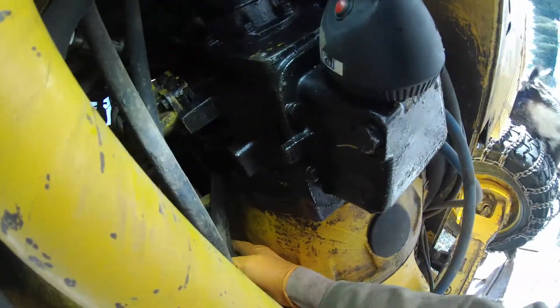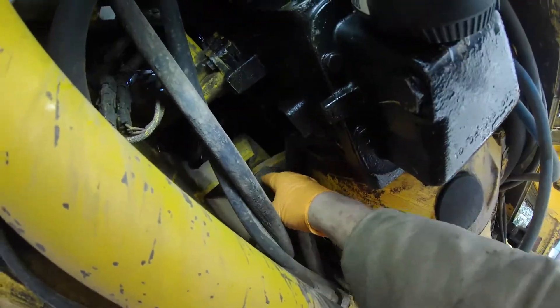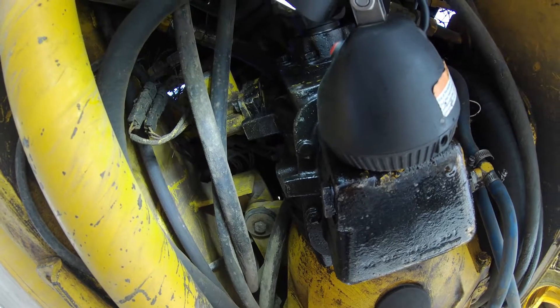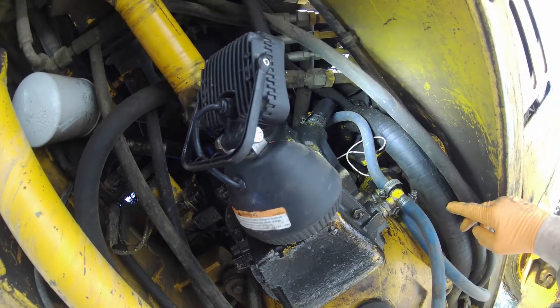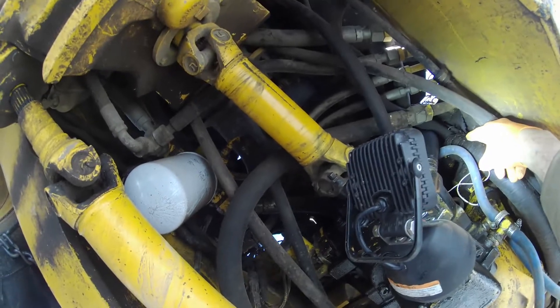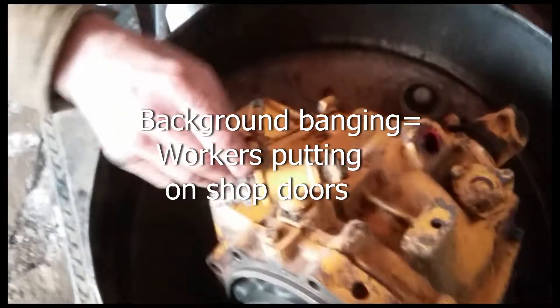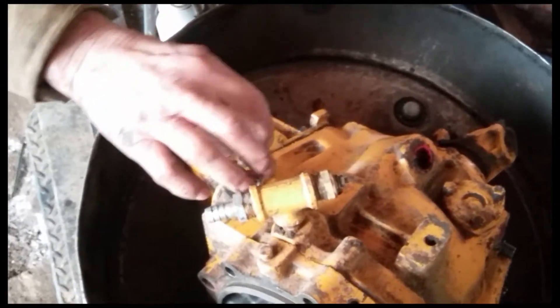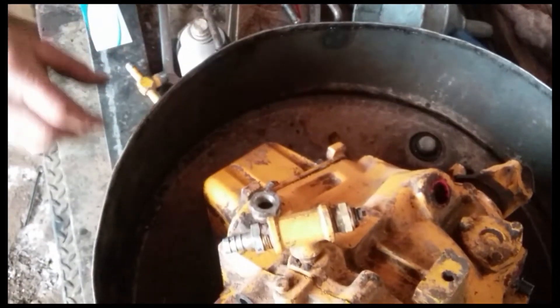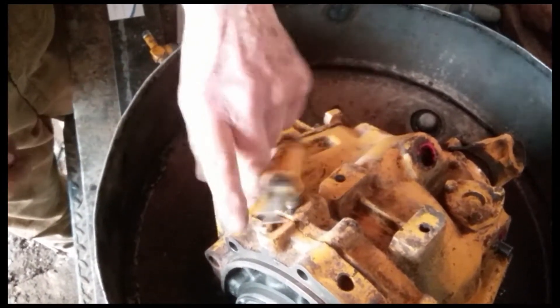This hose here also had to come off or be moved to get the ear past. You really have to watch the wiring and the hoses when you get ready to pull the reverser out. This hose has to be a non-collapsible type — it has wire inside it, which makes it hard to tighten so that it doesn't leak, same on the front end where it hooks onto the pump. Once the reverser is out on the bench, take all the fittings off but make sure you remember or have a drawing of which way they face, because when you put them back in they've got to be pretty close to right and you don't have much room to work.